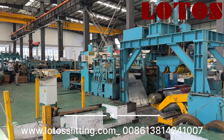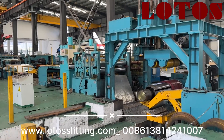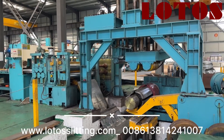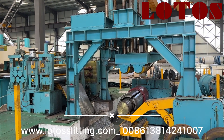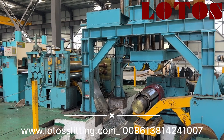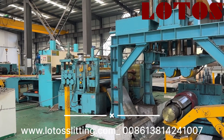In the first stage, this is the decoiler. It is a Genshi type heavy-duty decoiler. In this customer workshop they always want to do high-strength coils — the yield stress is about 550 MPa.